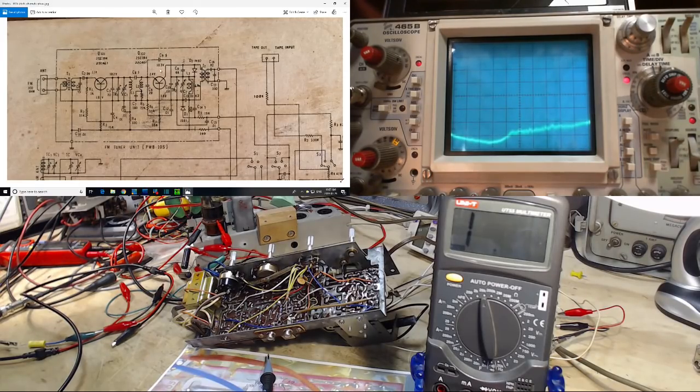Why wouldn't the 7,000 support the 2.4 volts? And what is a 2.4 volts? Well, it's the current flowing, I believe, from the supply here through 470. Well, it's that little capacitor, don't miss that, because the way they've drawn it, it looks like this is a continuous line, but it's not. Through here, through here, diode pointing the wrong way. So, clearly through here, of course. You want the plate current to go through this coil.